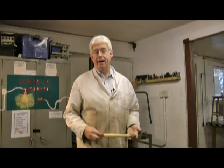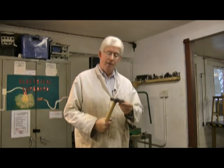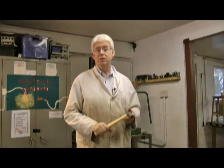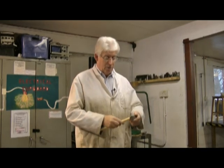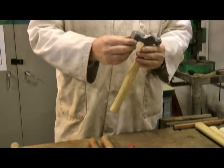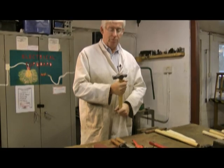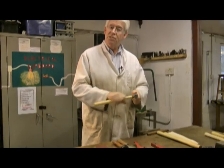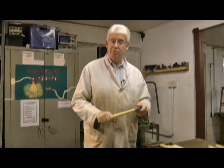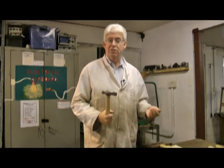Here we're looking at hammers and what we want to make sure is that we've got a good quality hammer that's safe to use, that does its job properly and will continue to do so for some time. So we check that it's a good make, that there's no signs of any damage or chips, and that it's got a new proper hardwood handle properly wedged and painted with linseed oil on the wood and engineering oil on the metal to protect it.